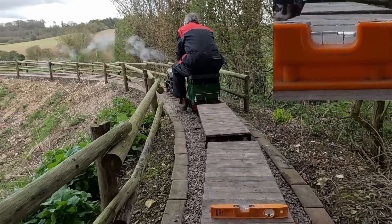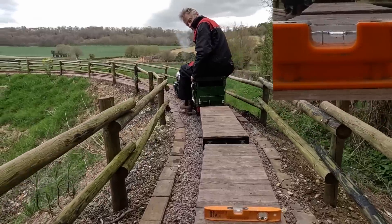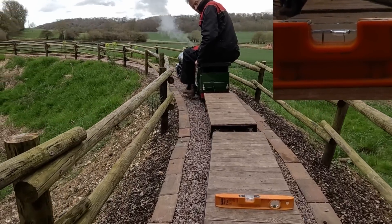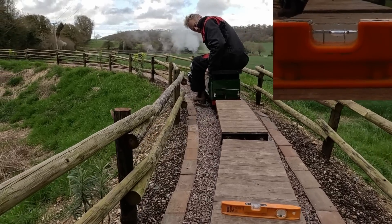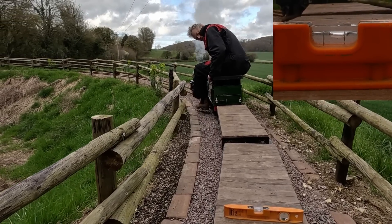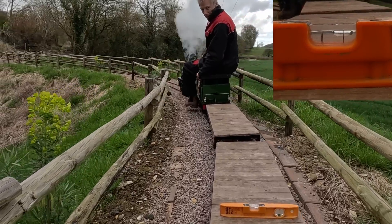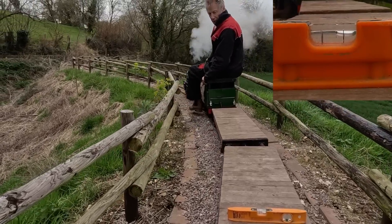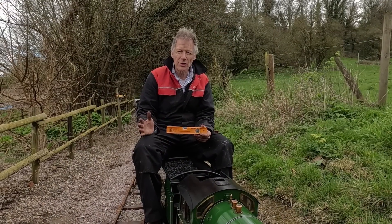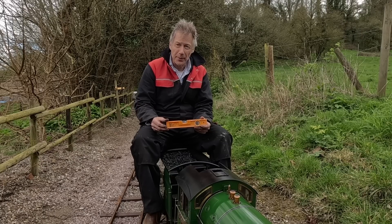Here on the beginning of the curve you can see there's a good bit of super elevation or banking up — and this is before we get to the bit that had failed. Definitely banked up here. Then it loses it a bit here — I'll work on that later. A little bit less there — I've got to do a bit more banking up in that section. It's probably sagged a bit since I did it. So we've had a complete steam around the line very slowly, and going around the curves should have shown the banking quite clearly on the little spirit level.